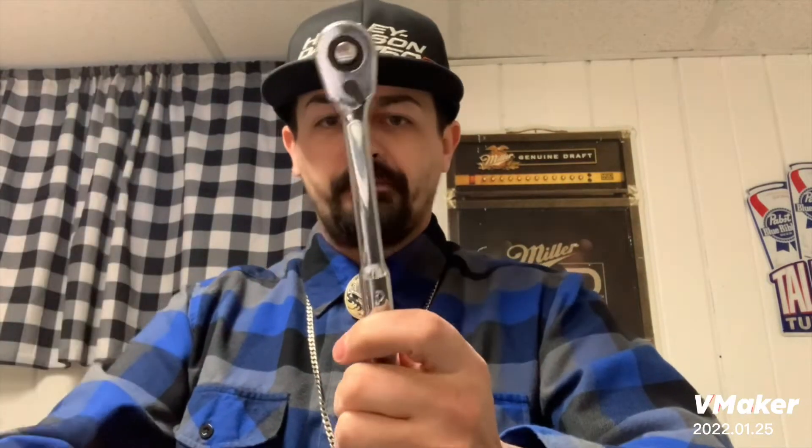On to the ratchets. I've used this ratchet quite a bit — it's got some oxidization on the back and the head's beat up a little. This was a 3/8, my go-to for a good while. I tried finding online and couldn't confirm whether the tooth count is different from old to new style. I feel like the old style was 60-some teeth and the new style is 72. The new style sounds and feels much better and smoother, though the old one feels a little more rickety and sloppy — granted it's been used a lot more.